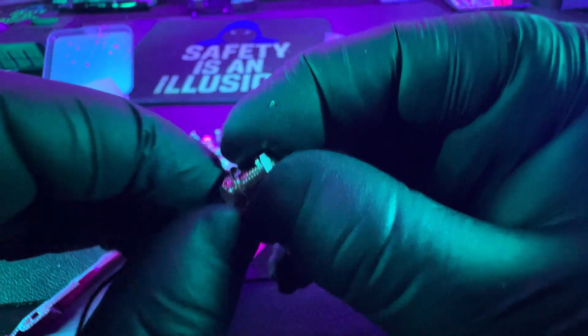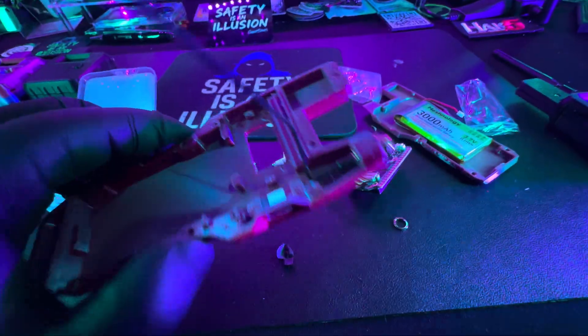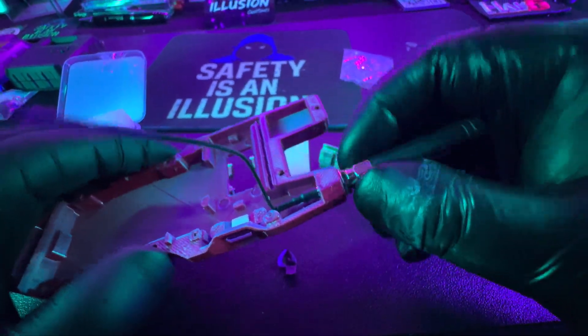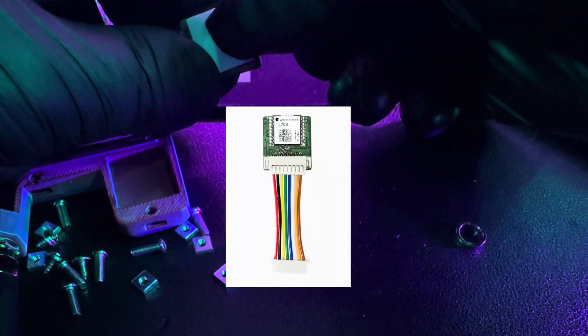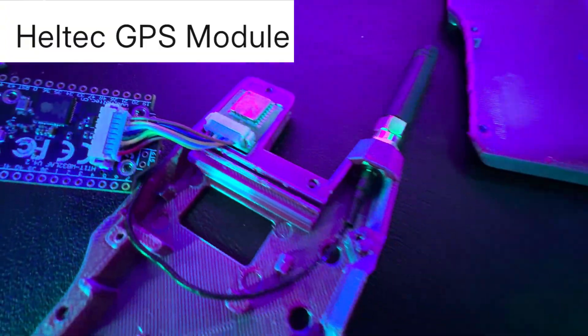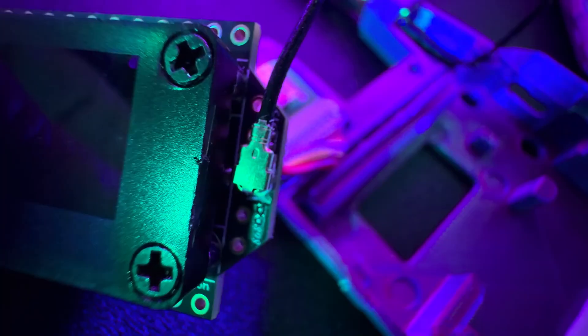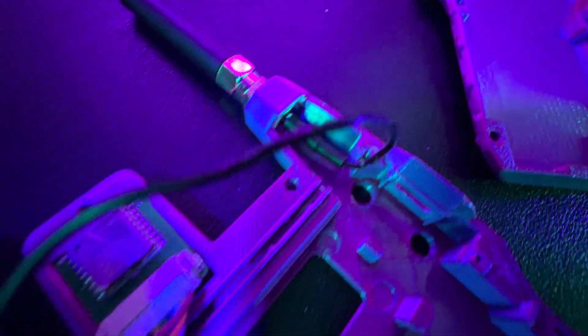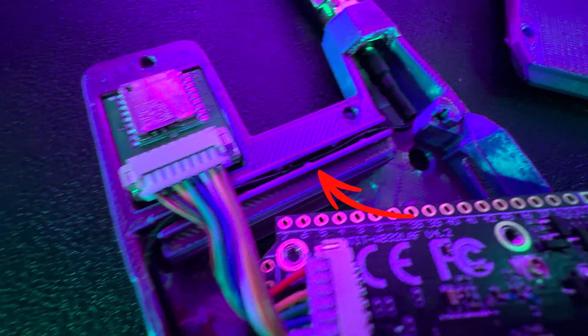Now I've built this thing a couple of times. I would recommend starting with the antenna — put it in, put the washer on, and then put the actual antenna on. Then move over to the GPS stuff. You won't see it here, but I put the adhesive down and stuck it to keep it nice and organized. Now get the Heltec V4 and plug into the GPS stuff first because the wires are kind of short — it's just easier to work with. You're going to take that antenna wire and connect it to the Heltec board as well, and there's a little gutter that you'll be putting the wire into to keep it nice and organized.